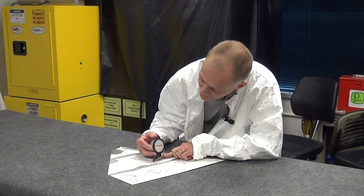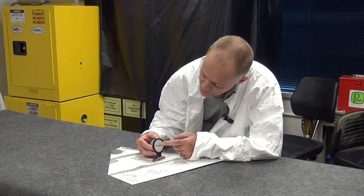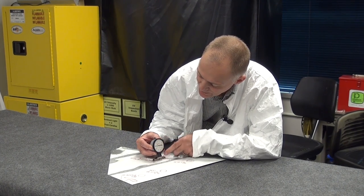There, right now. So we'll drop into the damaged area. On this particular depth caliper, for every one sweep we have 50 thousandths. As you can see on the dial, we go 25 thousandths here and then there's an additional 25 — of course added together that's 50 thousandths.